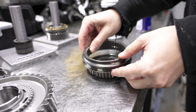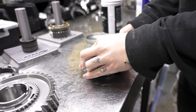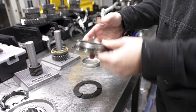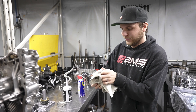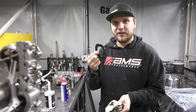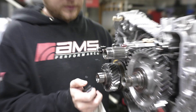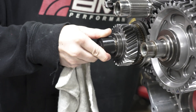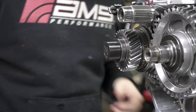Then you get them set - this slides over, and what you do is you kind of pop them in, into the spline a little bit like that, and then you push, pull, and pop them in. It made that so much easier. We used to fight with these things constantly trying to get everything in place. I worked with Cam down in R&D and we came up with this little design - a little half-hour-long print - and it made our life so much easier. Nothing locks this gear in place until everything's bolted together, and while you're working around it, it can't come off.